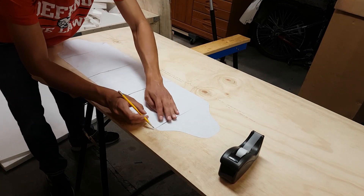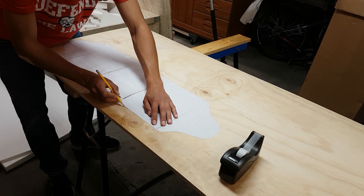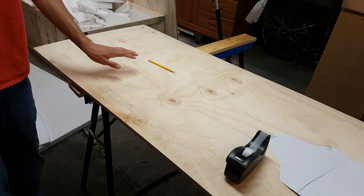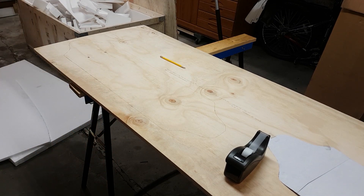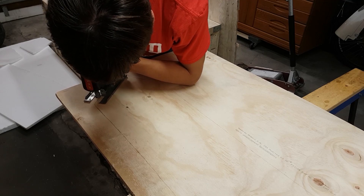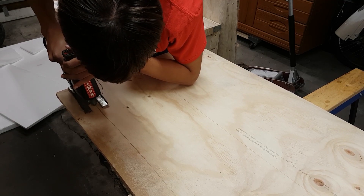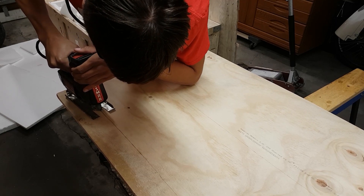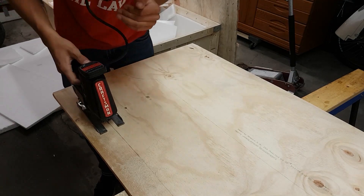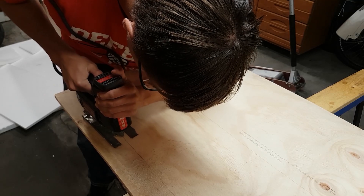Now we will talk about the skateboard. The material I chose was three-quarter inch plywood and I made the markings with a simple template I printed out from the internet. This material choice is not typical for a skateboard. Normally you would use maple, which is a hardwood meaning it's stronger and more dense. I will tell you why maple is used and why it actually wouldn't have made a huge difference for my particular board.